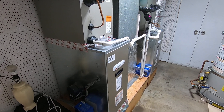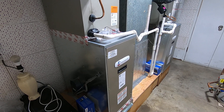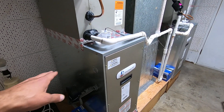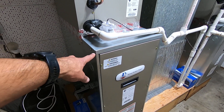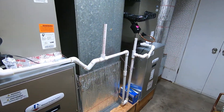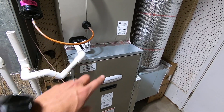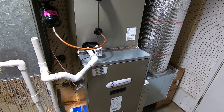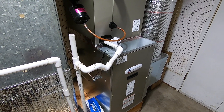That's why we went with these. We also went with these because they are the same size as a furnace. This unit right here is 14.5 inches wide by 30 inches tall by 28 inches depth, and the 4-ton version over here is 17.5 inches wide by 30 inches tall by 28 inches depth — so they fit back in the same spot, very easy to install.